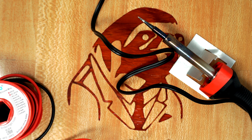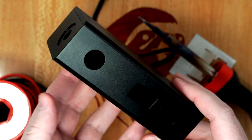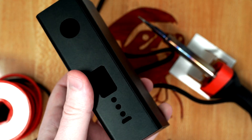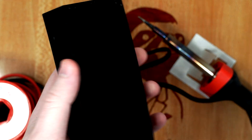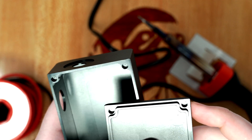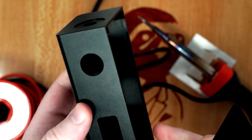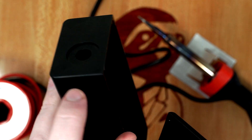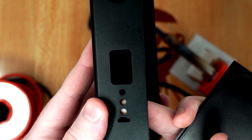Specifically for what we're doing, obviously you're going to need an enclosure. This is an Alpine Tech NXL box and I've never built a mod with this box before, so I might have a little bit of trouble. The holes are already drilled, which makes it much easier and cleaner looking. It has slots ready for the magnets that come included when you buy this. Pre-drilled out for a 16mm button, 22mm already recessed 510, and the screen, three buttons, and the micro USB.